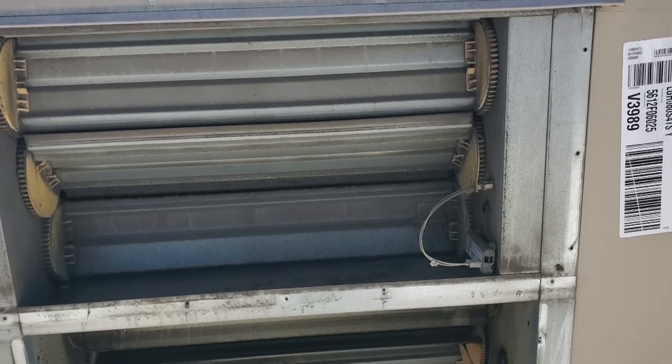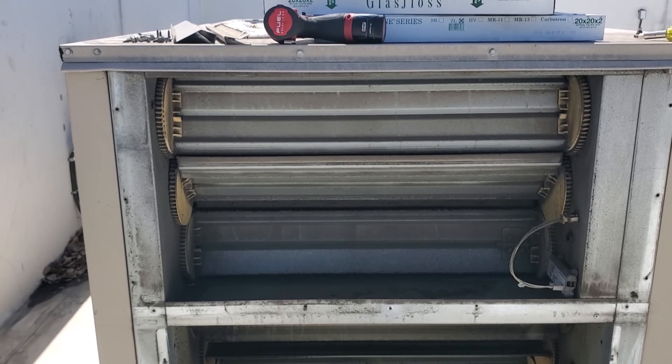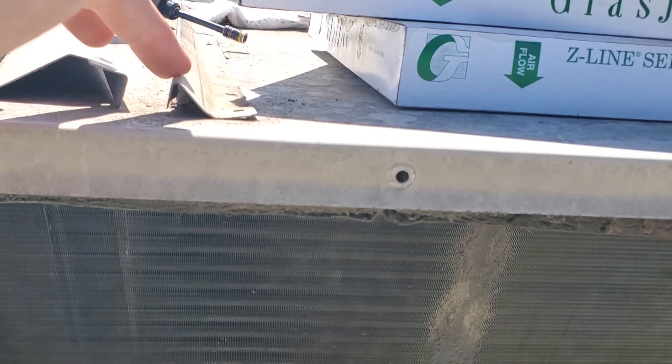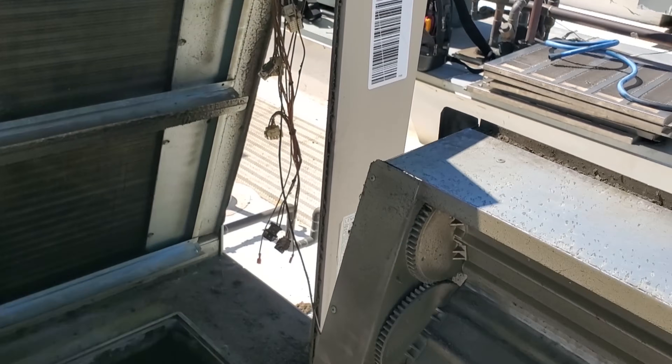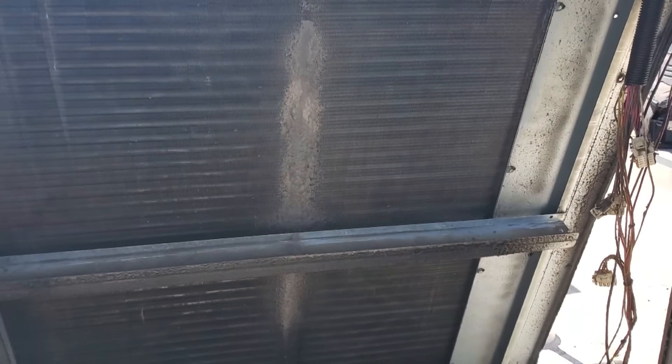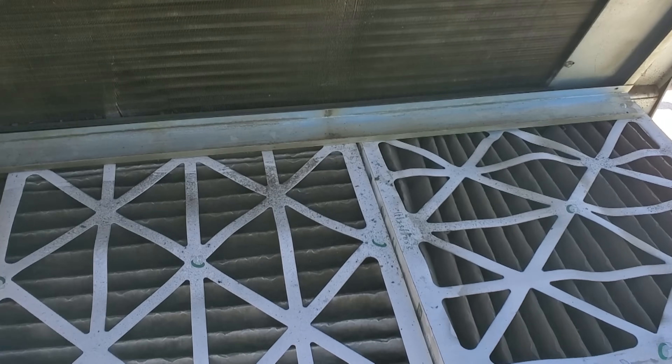I'm going to give it a couple more seconds of trying — just going to pull this little piece right here and see if that makes it any easier. If not, we're just going to have to clean it with the economizer package in place. Cool, it popped out — it was just this top retainer. Once I pulled that out, I just had to undo some clips and the thing popped right out. So the evap's not too bad, but I just wanted to get in here and give it a good thorough cleaning. It's best to do it from the inside. We'll knock this out real quick — take the old filters as kind of a catch and just start wiping this stuff. You'll see the stuff coming out of the coil, so we're definitely going to rinse it too.